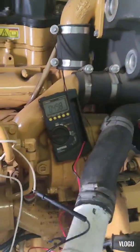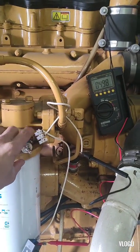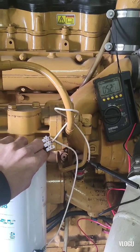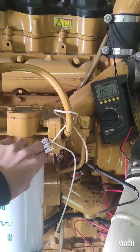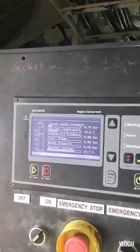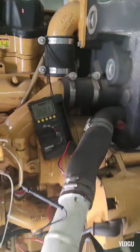Now I try to change the resistance value of the potentiometer to make a higher milliampere output and check if the water pressure on the monitor changes to a higher pressure value. At 6 milliamps, the reading is 0.75 bar. Therefore, the analog sensor failure A1 is 100% confirmed to be the jacket water pressure transmitter of the diesel engine.